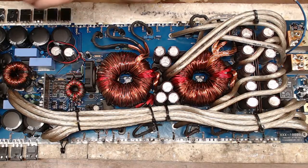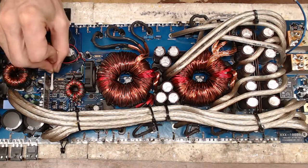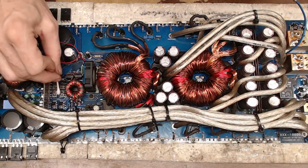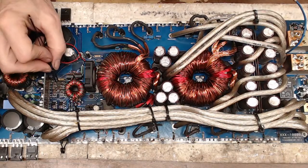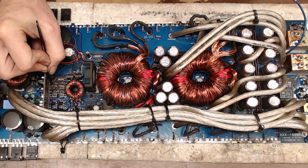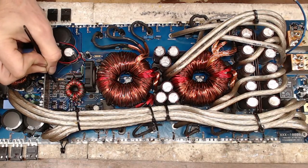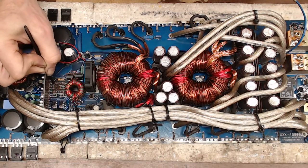Because what I do is I just remove the PCB, and then I'll use my Kapton tape to mold the back side of it and then pour it. But yeah, this is really just surface. Just on the surface. So as long as I don't have any conductive material between the pull-down resistor and the next transistor, I think we're going to be doing pretty good.